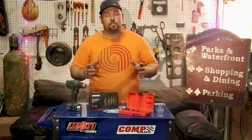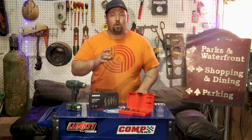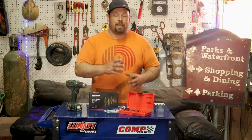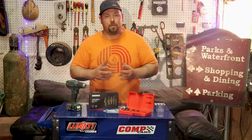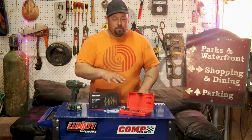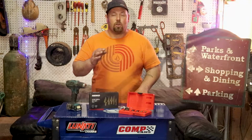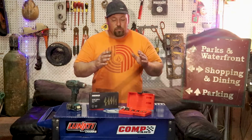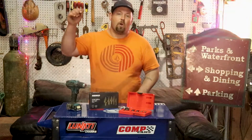Now, police package cars come with about 4 to 8 wires that come from the main fuse block. They come in through the cab, right where the center console would be. And then usually, with the amount of stuff like the cameras, switches, and lights, we would add anywhere from 3 to 6 more 4-gauge hard line. We use hard line because of the amount of electricity that flows through those police cars. Hard line wires, grommeted, all that good stuff. So you would get your grommets from whatever your vendor, and then I would use a step bit to drill through the firewall and through the roof.